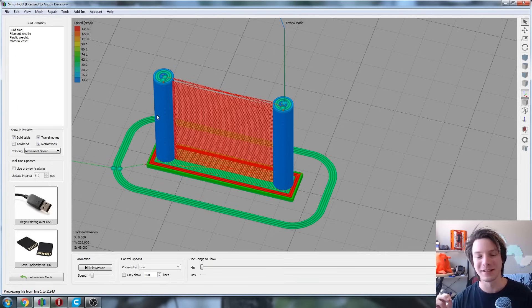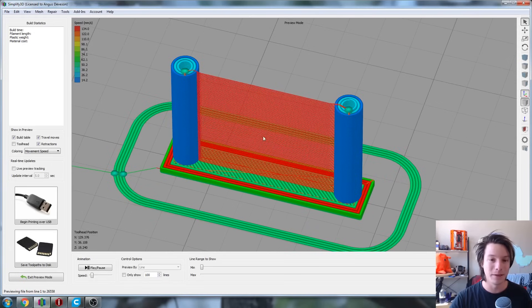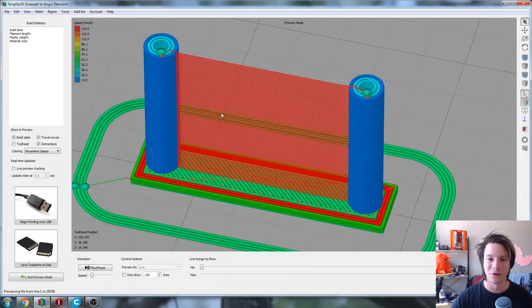This is Chaz Meister's G-code in Simplify 3D. You can just open any G-code in Simplify 3D because it has the best viewer, in my opinion. And that's what we want to find out. We want to find out what's stopping the stringing. And as we scroll back in this test, the red is a rapid, a movement. And that's because it's very fast because this is a different G-code to what's being spat out by Simplify 3D. We can see that red is clearly when it's moving between the points. This is where you would normally get stringing. So what's stopping the stringing?